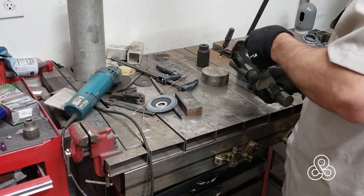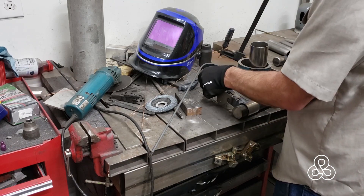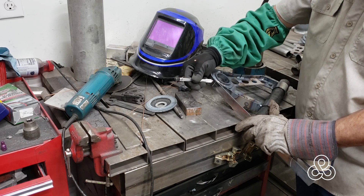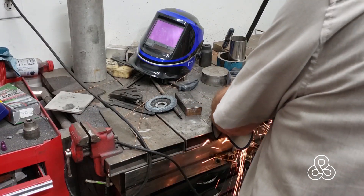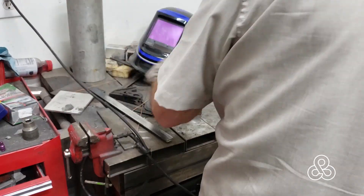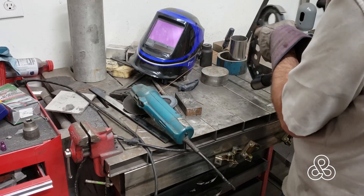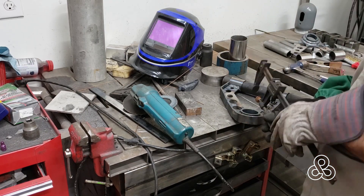Give it a bend around — a little elbow grease and a little hammering. Once you get it close, mark it off so it's going to match up with another piece of flat bar already mounted. Cut it off — always cut it slightly longer, you can grind it shorter. Cut it short, no strength in fill welds. Then go to the tried and true method: the ultimate leverage of a screw clamp to hold everything in place.